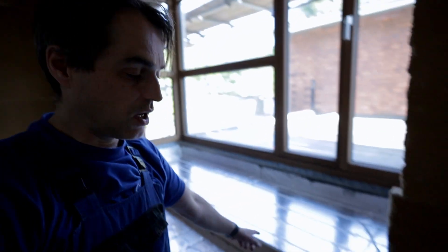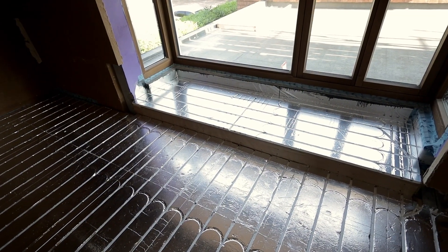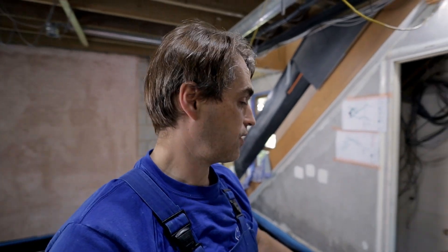I had to cut a hole in this insulation and route the pipework through here. The underfloor heating will be pressure tested on both floors, then the screeding company will come. We'll return in about a month once flooring and tiling is done, and we'll install the cylinder in that cupboard along with controls and commission the system.